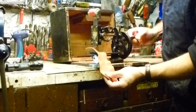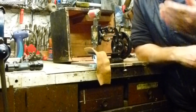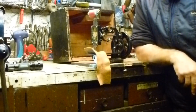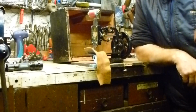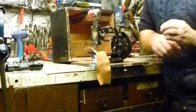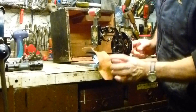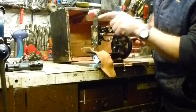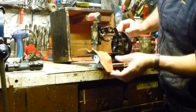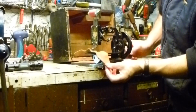And what Raymond did is he whipped over the border, because in America the patents were all sewn up by the giants, the Isaac Singers, the Wheeler and Wilsons, the Elias Howes, the Wilcox and Gibbs, Grover and Baker. They had patented everything. So he whipped north of the border and made a machine that gets around most of the patents, and it does it by walking the work through with the foot and a really simple chain stitch and tiny little automatic tensioners as it drops down. The teeth are on the underneath of the foot. It's really tricky, you can't see them, but it works. That's the great thing. I'll just go quiet for a minute so you can hear the mechanism.